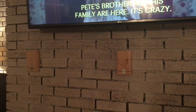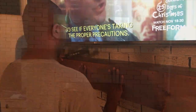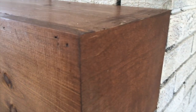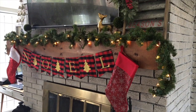So now I have my three anchors on the wall and it can be officially mounted. We took painters tape to mark where the mounts were so I know where to shoot. Then I took my nail gun and simply shot nails in through the mantle into the mounting wood on the top and the bottom to make sure it was super secure. And there is my beautiful mantle that I have been wanting to get done since we bought the house — and here is my mantle all decorated and ready for the holidays.